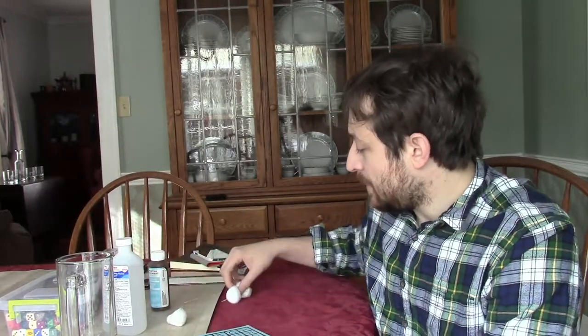I know there are other brands out there. Armor Etch is a pretty popular one and from what I've heard it's actually better than this, but all I have is this so that's what I'm going to be using. For an applicator, I'm just going to use a toothpick because I'm doing letters and numbers — it's a fairly small space. The cream does come with a brush, but the problem is the brush covers a fairly wide surface area, so you might have to tape off the edges to avoid getting excess. And if you want to use stencils, that's also an option.